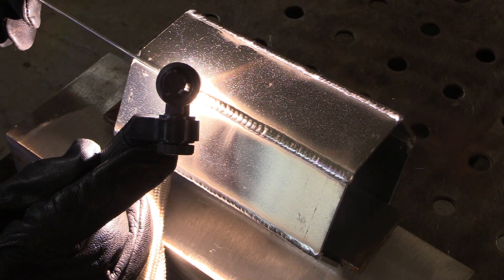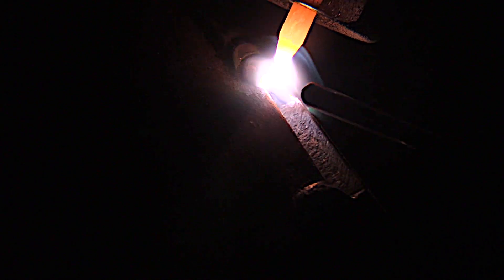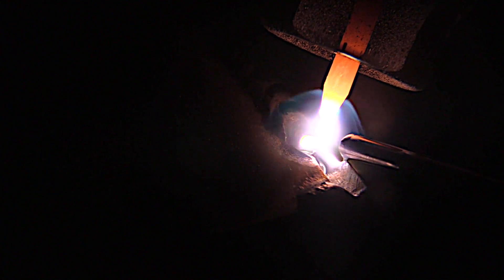Here's a joint from a video I was working on not too long ago, and this is an example of where I don't have my argon quite tuned just right. There's a lot of milkiness, a lot of oxide floating around in that aluminum puddle. It's doing okay, but that clear cup is the reason we can see all the detail in that puddle.